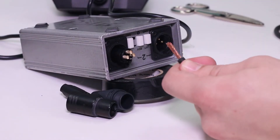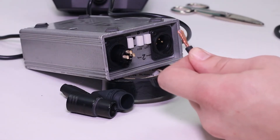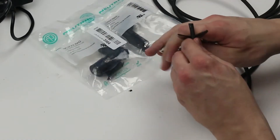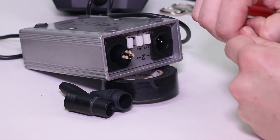The second step is to remove a bit of the outer jacket from the end of the cable. Aim to remove about a half inch off of the end of the cable. This is really easy with a good pair of wire strippers. You can also do it by lightly scoring the rubber jacket with a razor blade and then tearing the jacket away.